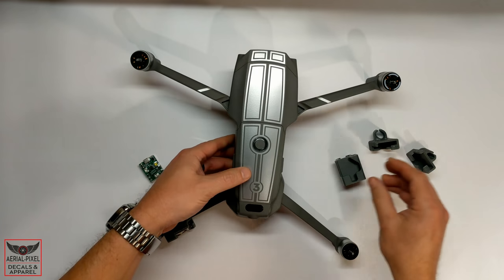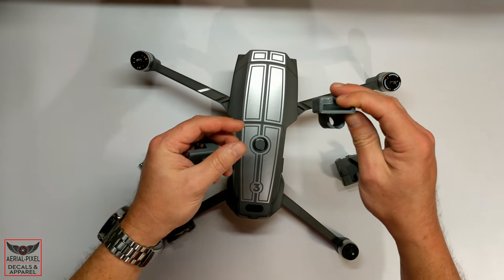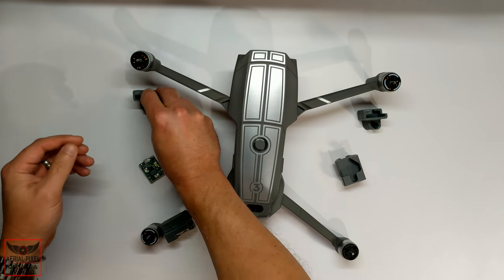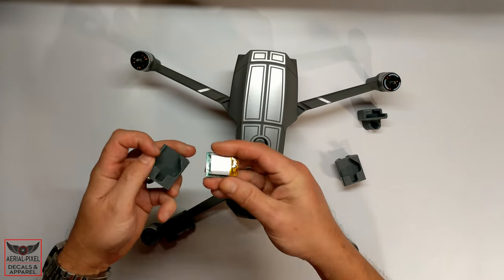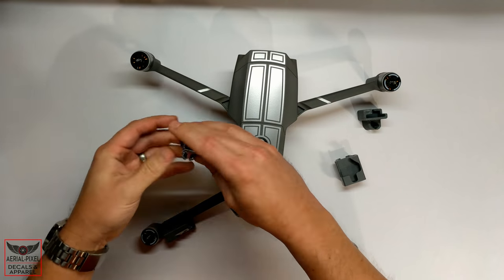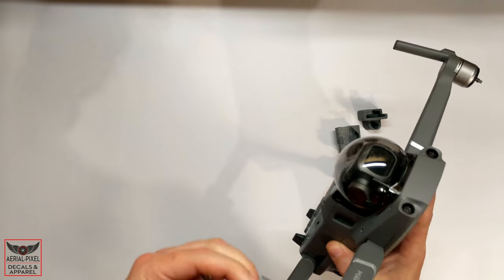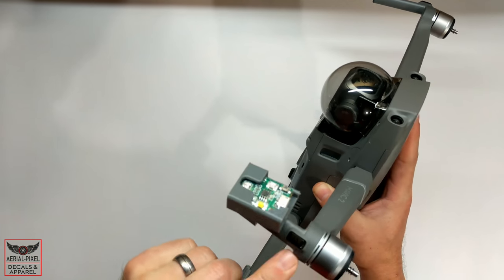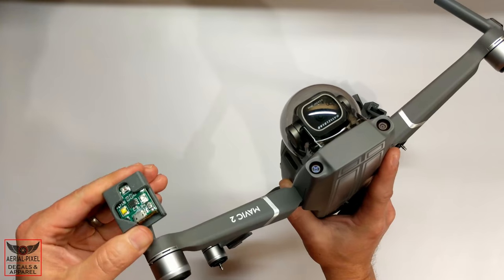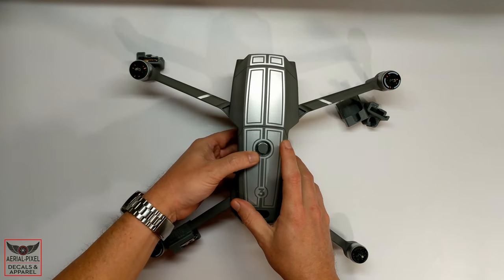To do the front one, grab one of the front mounts. These front mounts are handed — you have a right and a left. You can see how they're angled so they appear level when installed. The one angled this way goes on the front right foot; the other goes on the front left foot. Grab another Arc strobe, bend the catch away, slide it down in place, and that springs back. Then just slide the mount straight onto the foot — it's friction fit. You can slide it up or down: push it toward the bottom of the foot if you want the front LED display visible, or push it all the way up if you're not concerned about that. Then just repeat for the other side.